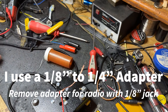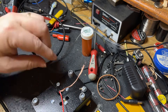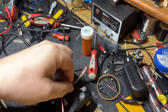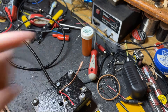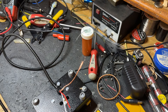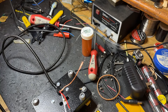And that brings me to where I am right now. I am soldering. This came with this clamp here, and I went ahead and clamped the cable after I stripped it back. I'm going to use the shield for the ground — for the common. I'm supposing that red is going to be tip and white is going to be the ring, but I'm going to verify that with my multimeter right now.